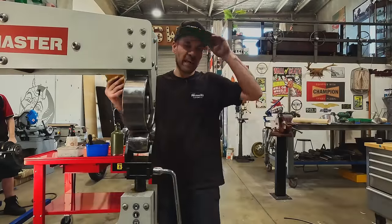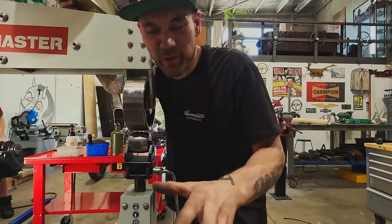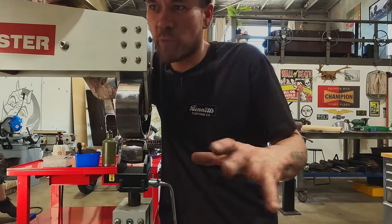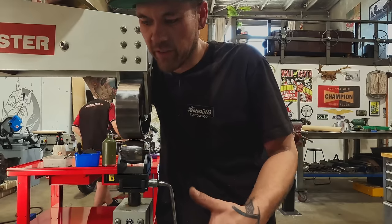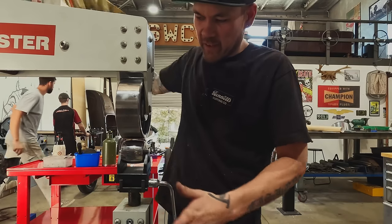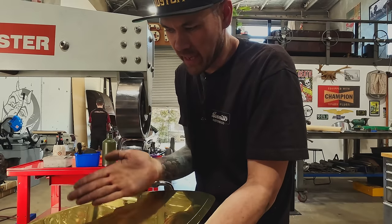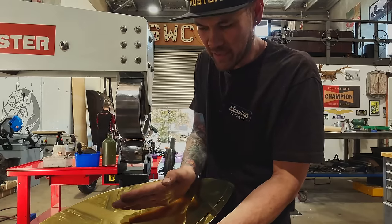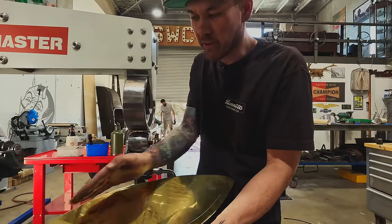Okay, so I learned, the last time I was here, I was talking to Aiden. I went to Bespoke Coach Works and was able to learn some stuff from Aiden. And he said, whatever you want to learn, I'll show it to you. And I said, reverse curves, teach me about that. So that's what he did. He showed me reverse curves in the power hammer, reverse curves in the English wheel. And basically, for our reverse curve here, I need to stretch the top of this panel to get it to curve this way. So to do that, I'm gonna start with the English wheel on the inside and work my way out. And that's gonna push the metal wider and wider as it gets to the outside.